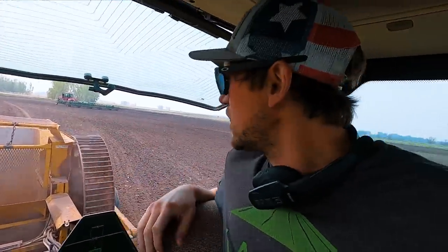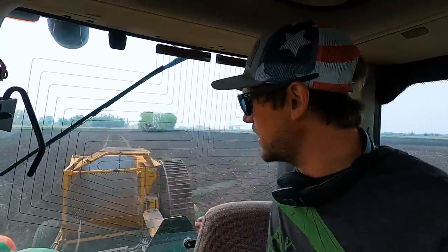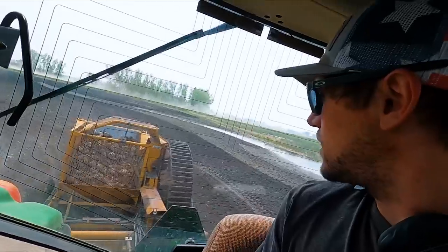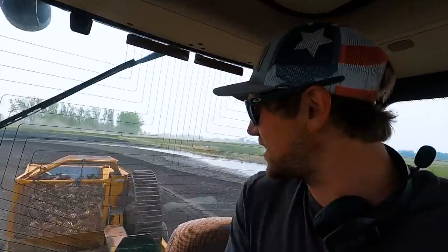They're yielding really really good — rocks really coming in. Oh, she's working like a dream. We need a high-speed one of these — this is so slow. You've got to go 2.2 miles an hour, which is maybe still too fast. You go too fast and they dump out of the wheel too far and it'll start coming around. The basket on this thing should be three times the size. I've been at it for about an hour and a half making some progress — there's a lot here as you can see. But I have to go load seed for Brody. Randy's going to come and try to operate this thing, so I'm going to train him in on it.